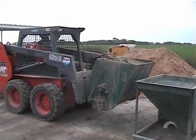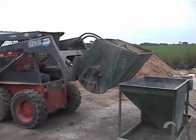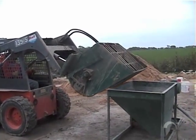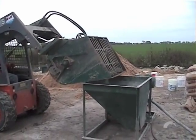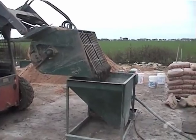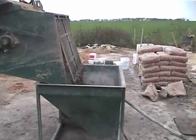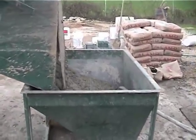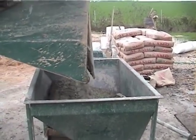He is preparing now to dump into the hopper. The mixer is still turning. This mixer is built purposely for this hopper. We walk up to it and tilt it forward — as you can see, we're starting to pour into the hopper now. This is the right consistency that we can spray quite nicely. He's going to get as much as he can out, and then our man is going to come back up and scrape the balance of it out.